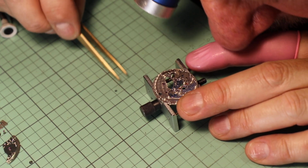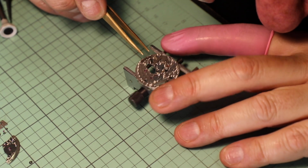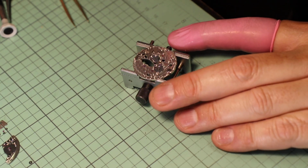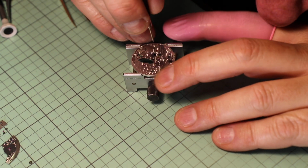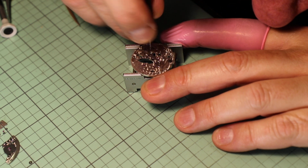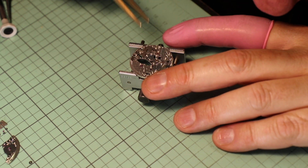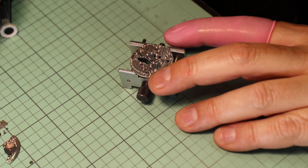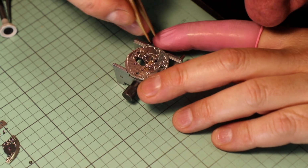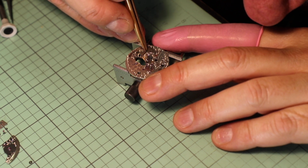One of them can grind up with your sliding pinion. A lot of times a customer brings a watch in and says, my watch sounds like it's tearing up inside. I'm going, well, guess what? It's tearing up inside. So you change that wheel and your sliding pinion. And when that stuff tears up, you can end up breaking the end of the stem too. You end up changing that too. So this is our retaining plate jumper spring.